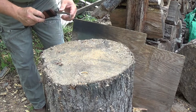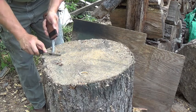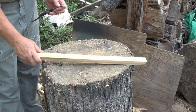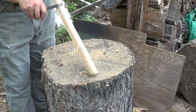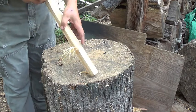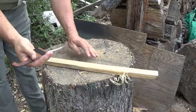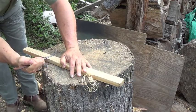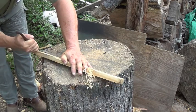Now what they would do is take this in soft wood. I really don't have any soft wood - I have a piece of pine here that's almost rich lighter. I'm going to try to demonstrate the uses of this crook knife. This is an old piece of yellow pine, and you can take this knife and round the corners - see how square the corners are - you can round the corners off, say if you wanted this to be a handle and you didn't want the corners there. You can also use this knife as a plane - it's made to fit in your palm and has an angle to where you can take the knife and plain wood.